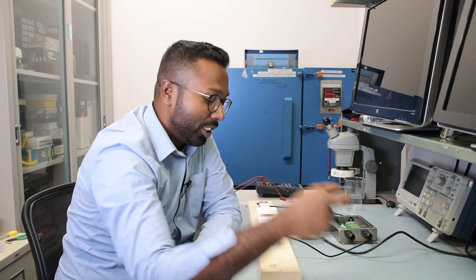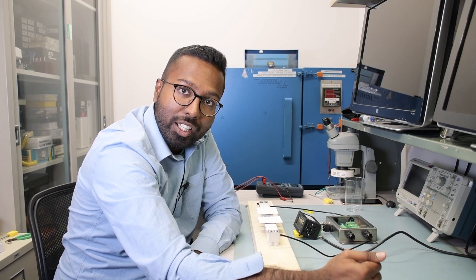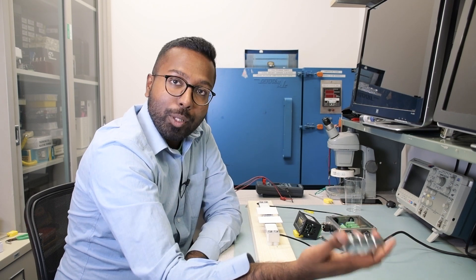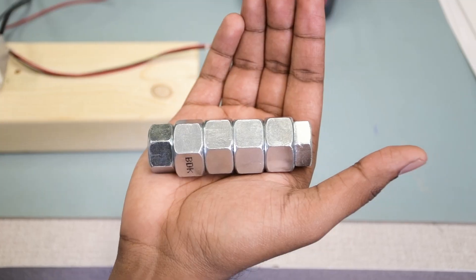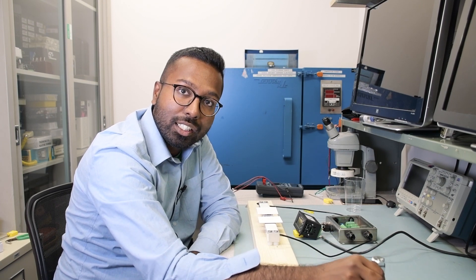Now that we're done wiring the junction box with the load cells, I'm going to show you the setup and adjustment of these interchangeable load cells. Interchangeability typically means that one load cell's reading is within the rated specification of another identical load cell of the same kind and range. For the adjustment, we have a known dead weight of 0.378 kilograms, which we'll apply on each load cell and measure the signal from each.